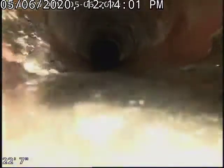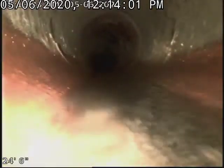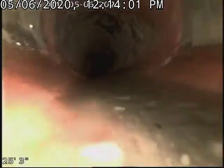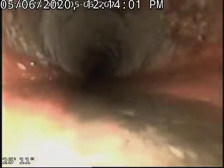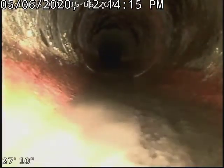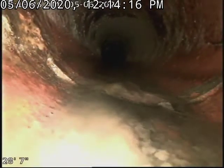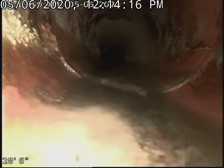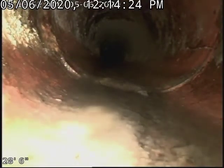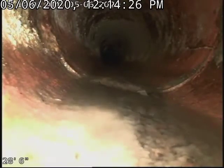See how the water has to go up and over that lip to leave — that'll catch debris, and that's the whole thing. You want your sewer and everything to go out of your house correctly. You can see that the sewer is cracked 28 feet out — it is cracked on the side, on the right.